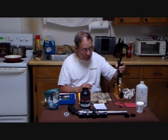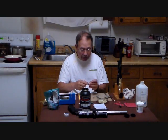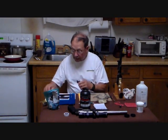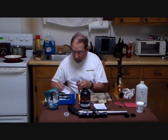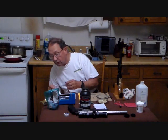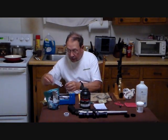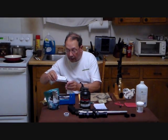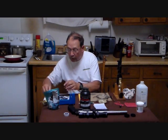We are also proceeding now to use Triple Seven powder and elongate bullets. What I'm doing now is scraping some of the excess lubricant off the bottom. We've found out with Triple Seven powder that with this bullet we can use the same volumetric load that we use with black powder and round ball — which was 57 grains — and that translates to 42.7 grains by weight. Triple Seven is much less dense than black powder, and that's the reason for the difference. It also compresses better than black powder and it is somewhat sensitive to compression, so you want to make sure that you use exactly the same force all the time.